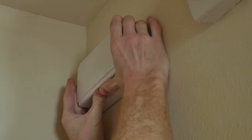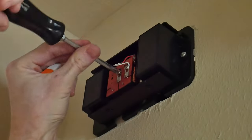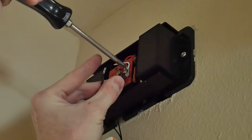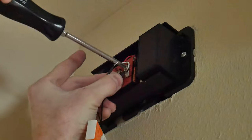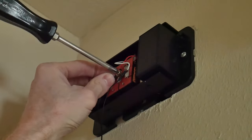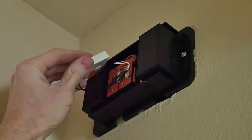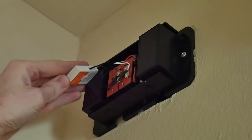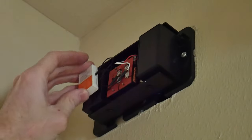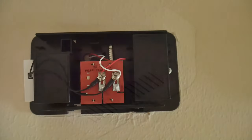We then need to install the Pro Power Kit to the mechanical chime inside the house. Simply remove the cover and connect the fork connectors to each of the chime's power terminals. I didn't show it here, but I did verify this circuit was dead before messing with it. Note the original wires will stay in their same location on the chime, and the power kit connectors are additional items on these terminals. Once connected, position the power block in the chime so that it does not interfere with the cover — the block comes with a piece of adhesive for this purpose. I tried it on the front of the assembly but later came back and positioned the block on the side so that my cover would fit better.